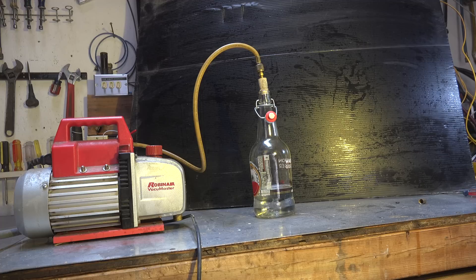There are a number of reasons why you wouldn't do that. Number one, there's moisture in the air, and especially with these R-410A machines we're dealing with now, you really don't want to deal with moisture in them if you can at all avoid it. So you would put new refrigerant in and put dryers in, and so on.